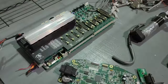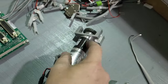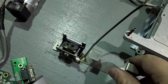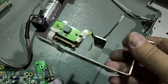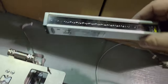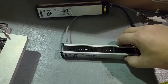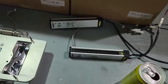I've got several DC servo motors, and these ones have gear reduction — probably multiple stages. I have some cameras slash barcode scanners; they're USB mini. I also have some infrared detectors made by Banner — the LX6E and the LX6R. These are about four hundred dollars each, and they detect lots of small things.